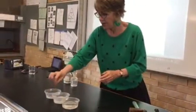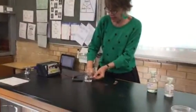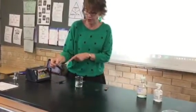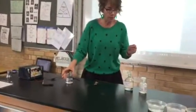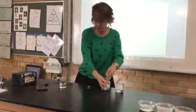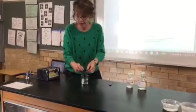And that brings us up to our most important step that happens all the time when we are restoring a metal object, and that's electrolysis. Our object needs to be connected to the negative terminal, and we need some inert electrode on our positive terminal. We need to also select an electrolyte, and we're going to go with the same one we used for the water baths. We know if we used an acid that would accelerate rusting, so we'd use sodium hydroxide again as our electrolyte. And remembering to connect our artefact, which would be totally under the water, to the negative, we'd carry out electrolysis.